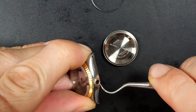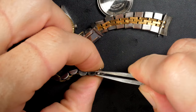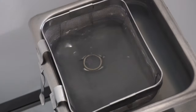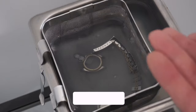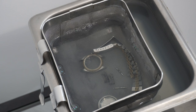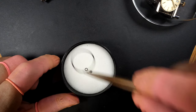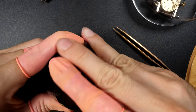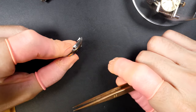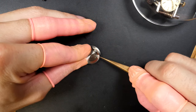Now focusing on the case. Removing the O-ring and gaskets — replacing them because you want the watch to be watertight. Removing the bracelet parts and putting everything into the ultrasonic cleaning machine. You can see the fumes coming off — that's the dirt coming out. The ultrasonic reaches all the little spots to remove the dirt. Fitting new gaskets and new O-rings, lubricating them with Molykote.